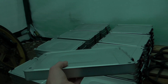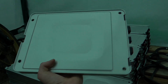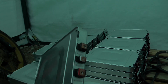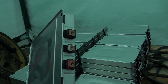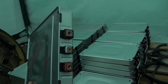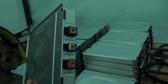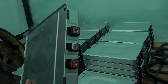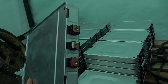These things are not too heavy — they're around three and a half kilos. Each one is actually four cells: two in series, two in parallel. The terminal with the white plastic behind it is the centre tap for seeing the individual pairs of cells in parallel, and that's the centre point between the two sets of two cells in parallel that are in series.